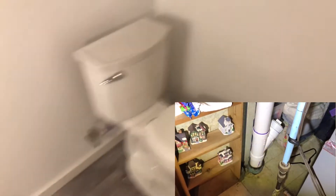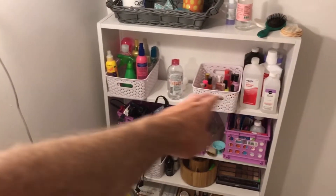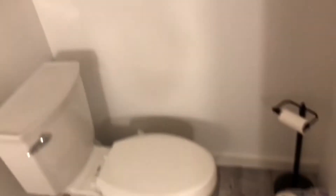The stack is in the wall and I'll show you what that looks like in some drawings. The sink over here goes into the wall and around through this wall right here behind the knee wall. There's a gentle bend, it goes behind the knee wall, another gentle bend, and it comes in and joins up with the stack right here. Everything exits right here and the stack vents through the roof right there.